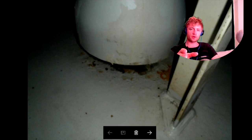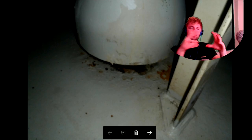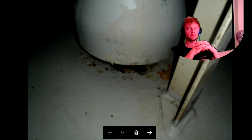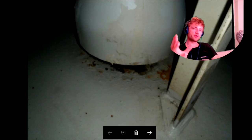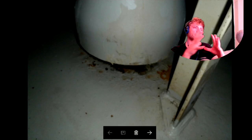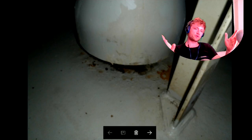It's also very important to check that there is no dirt in the bilges. The normal procedure in the engine room is to clean the bilges and be sure nothing is inside — the cleaner, the better. Because in an emergency condition, if you suction this water, all the dirt will go inside this pipe. This water is suctioned by the main condenser COPT pump, which discharges to the coolers — so any dirt in the bilges will end up there, and your central coolers may become dirty. But who cares — it's an emergency.